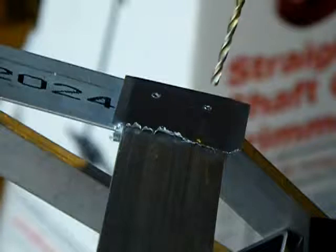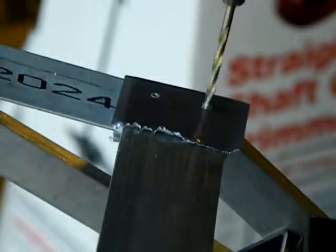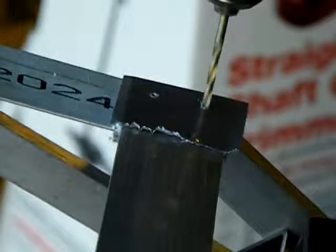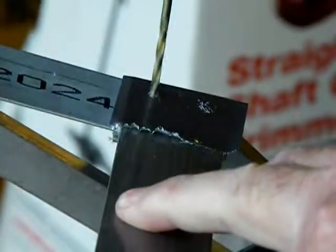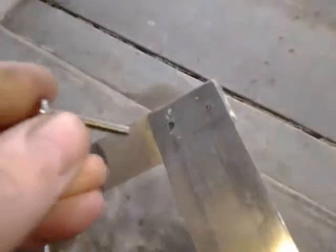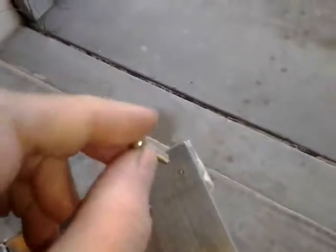At that time, I located the holes in the end of the top plates and drilled them straight down through the Quick Steel and the angle aluminum. These holes will be used for the 8/32 machine bolts to hold the top plates on. But an 8/32 bolt will not fit through an 1/8 inch hole. So the holes in the top plates must now all be enlarged using a 3/16 inch bit. And the holes in the angle aluminum must be tapped with an 8/32 tap.